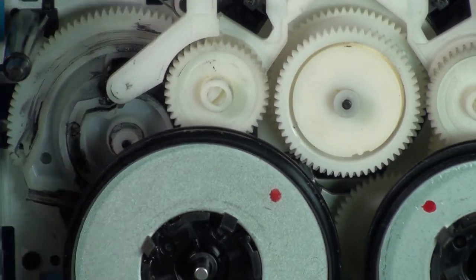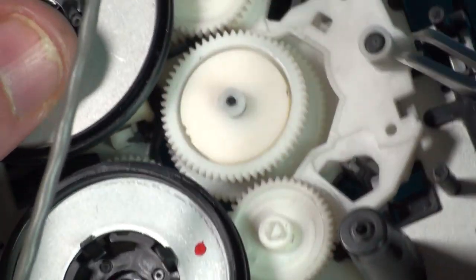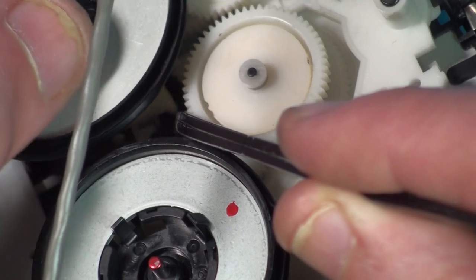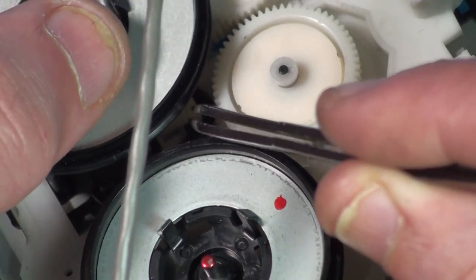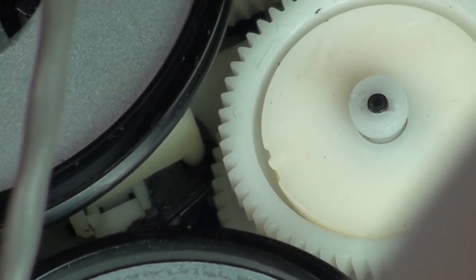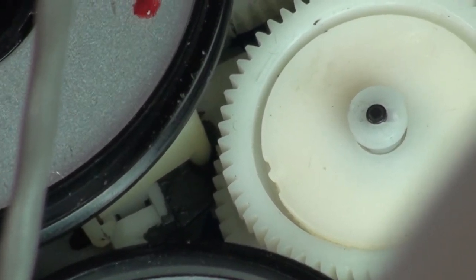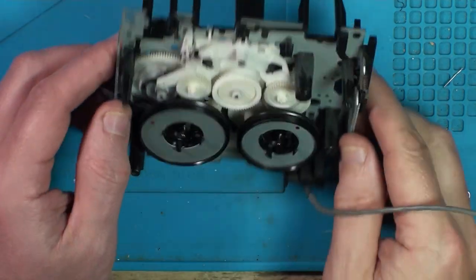That whole arm assembly comes down to here, and it's this little arm in there that you can see moving, which pushes it up. So either something in there might have worn out, because that is running inside another piece of plastic that's full of grease. You can see that arm moving, which pushes that other bit of plastic up. So it's either something slightly worn down here — it's just not pushing it up high enough.